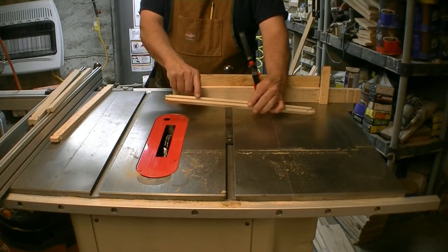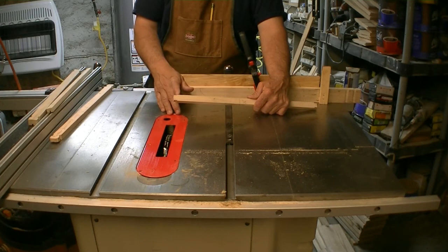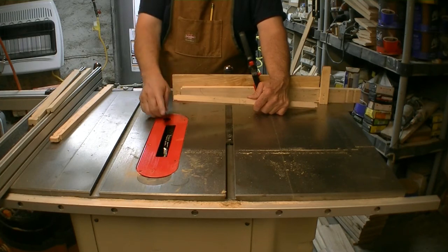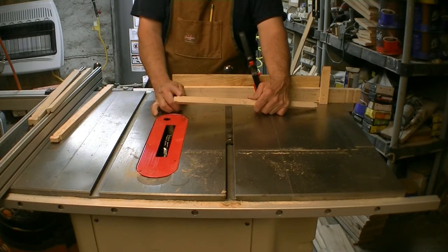We're not going to cut the top. Okay, we're not going to cut the bottom. We're just going to cut the two sides. Okay, you're going to do an 1/8 inch cut. The blade's set to it already, and 3/8 inch backward, back to here. From here to here, 3/8 of an inch.